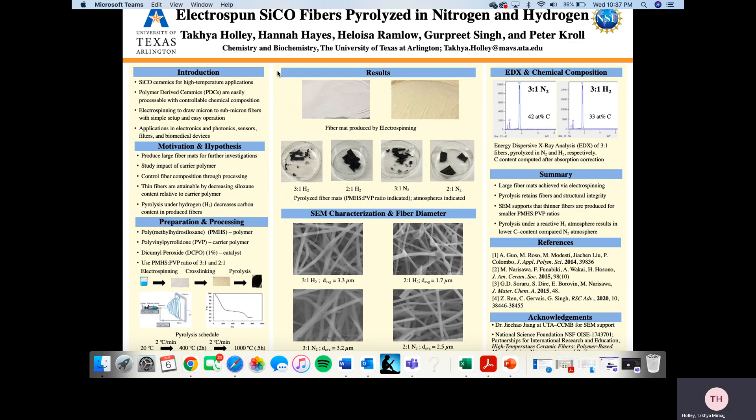After making the polymer solutions, they are then electrospun using the parameters of a receiving distance of 25 centimeters, feed rate of 5 milliliters per hour, rolling speed of 500 revolutions per minute, and voltage of 13 kilovolts. This is all done in two hours.